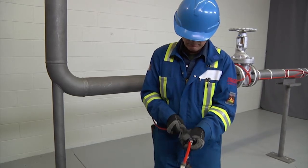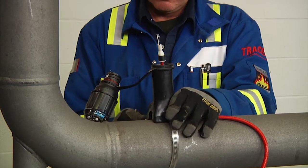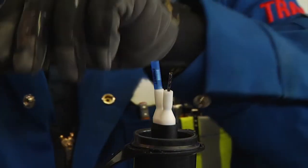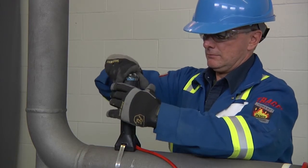Next, pull the cable back into the stand until the braid is just visible above the strain relief. Fasten the stand to the pipe with pipe straps. Then place blue crimps on the bus wires, crimp the power wires to the bus wires, and install the end cap over the cable end.